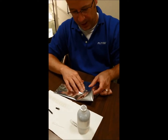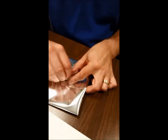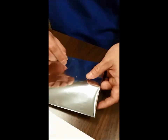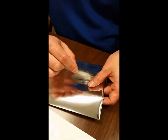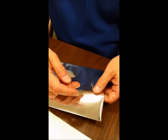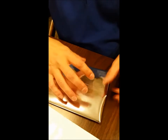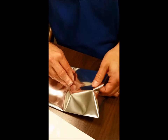I've got oil in the valve and my silicone pad behind my substrate that I'm going to punch. I'm just going to make a hole. It's clearly all the way through the packaging film. Sometimes people will poke a hole by hand and it looks like the hole is there, but what they've actually done is extended the sealant layer on the inside of the bag material and you don't really have a hole. That can create a failure in application — the bags will puff up and they won't degas because you don't have a complete hole in the bag.